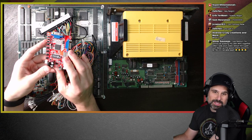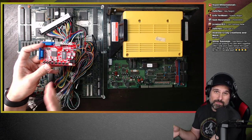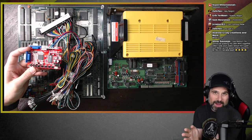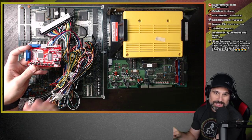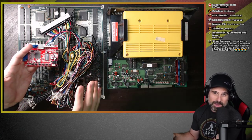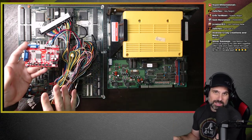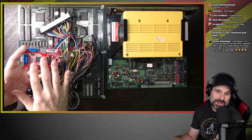You need to know this is a step, and also these things are not always plug and play. You'll notice there are little switches on here — some are to change the vertical and horizontal position of the display, and some adjust something called 'clamp,' which can push the image over if you're getting a black spot on your monitor. You're going to have to fiddle with it. If you're using a modern LCD display, nine times out of ten the display will have to be adjusted — brightness, contrast, vertical and horizontal hold — so just know it's not going to be plug and play.